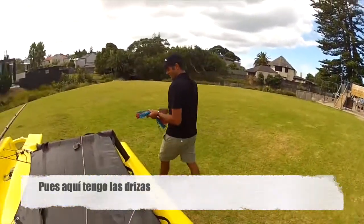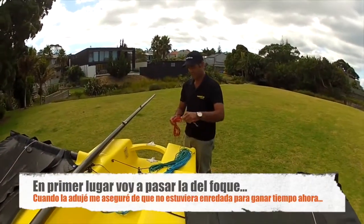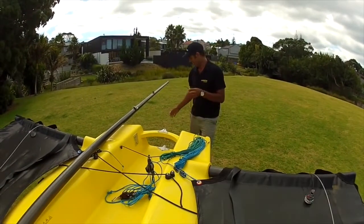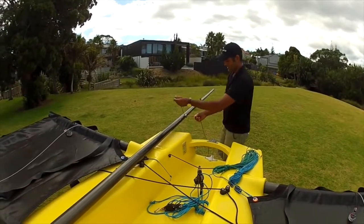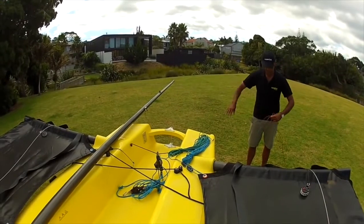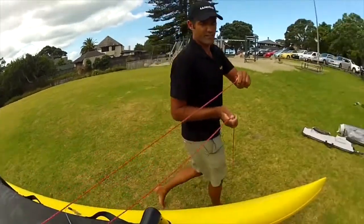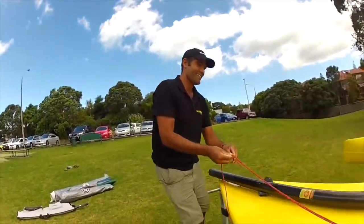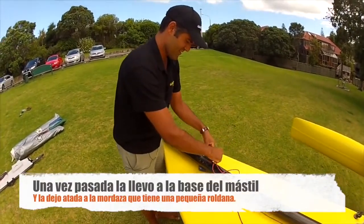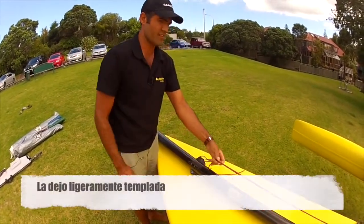Got the halyards here. Firstly I'll run the jib halyard — undo that. The big trick is when I de-rig these, I do it in a way that there are no tangles, which makes rigging a lot quicker. I go through there, run down the halyard, then take it round — over Miranda's head — and that halyard goes into the jib roller here. Then I just tie a simple reef knot, reasonably tight.